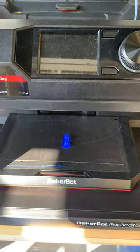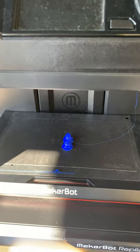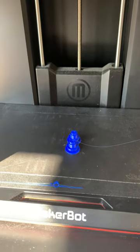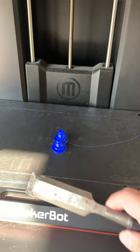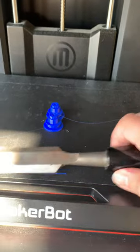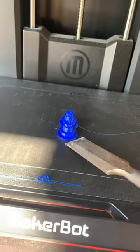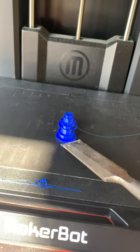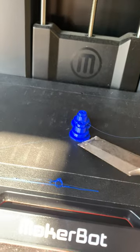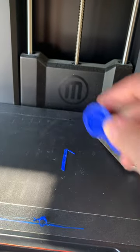The last steps of finishing up our 3D printed peg for our gear assembly is to remove it from our 3D printer. If we're on the MakerBot we might need to use a tool like a chisel in order to help us. These are chisels — there are some in my classroom and also some in the lab. If you are going to use a chisel, just wiggle it right underneath. You'll hear it kind of peel up and then you should be able to either continue to chisel it or just peel it off with your hands.